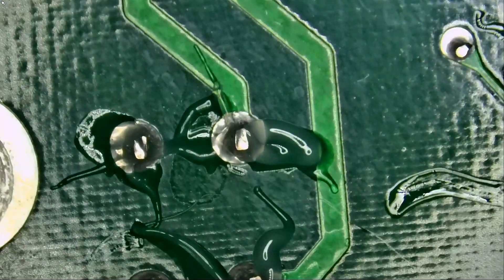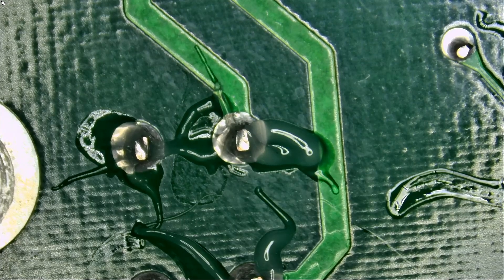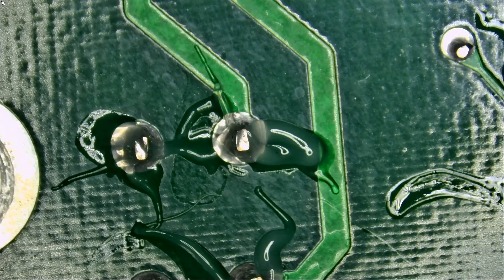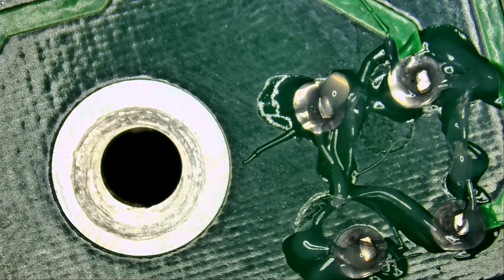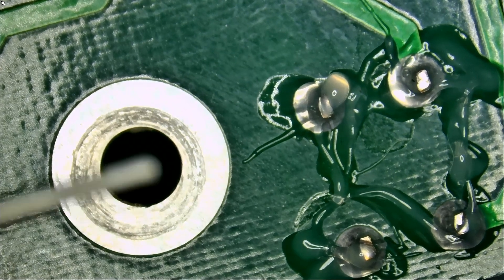Not too bad — not my favorite method, but let's try low melt solder as an experiment so I can show you the difference. It's going to make a huge difference because low melt solder will stay liquefied for five, six, seven seconds after I remove the soldering iron from the joint, and that will give us enough time to suck the solder off the board while it's still soft. There are 101 ways to desolder a pin — I can also use a braid wick with hot tweezers, or use hot air to pull the whole relay off. We're just experimenting with different ways so you can learn.